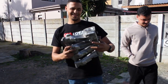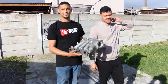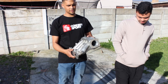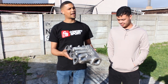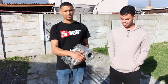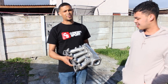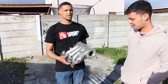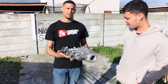That's it guys, so we're gonna do cinematics of how we're doing the process, and in between we'll add a few words, but we won't be mainly speaking because there's nothing we have to explain. Wrinkle spray is a process. You have to heat the part, and then I'm just gonna wrinkle it. You wrinkle in three directions, vertical, diagonal and horizontal, to get the most aggressive effect on the wrinkle. I wrinkle a thing in about an hour or so. But then you can't touch it or use it for another 2 hours. It must sit. So in that time, we're just gonna do some cinematics like Carlo said, and then we take it from there.